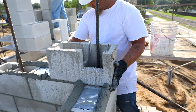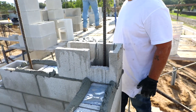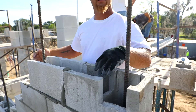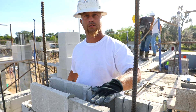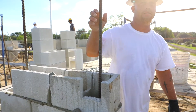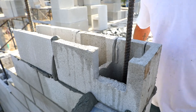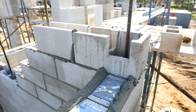Hey Lamar, do you have any corner bars up here? I doubt it. Hey Tony, this gets a double, right? Double steel? Yeah, I'll need two. Now what's a lintel block? This block here — it's called a lintel. Steel goes down in here, and it's filled up to here with concrete. And that makes your tie beam — ties the whole building in. This is like your skeleton. Right. So this cut out here is to allow the concrete to flow around the corner? Yes, and it makes a beam. You stop it off in these holes here and it makes it a beam. Ties all steel together.